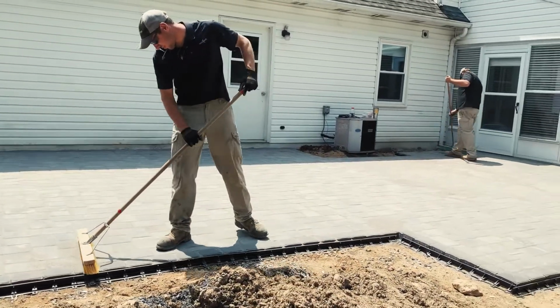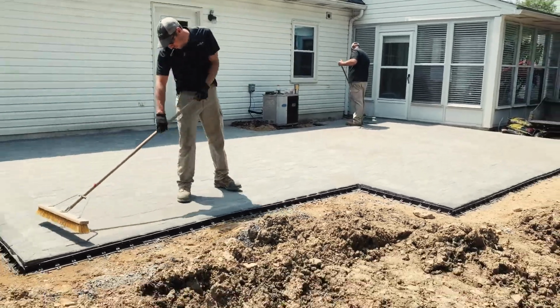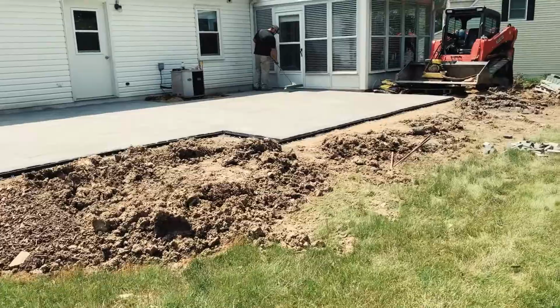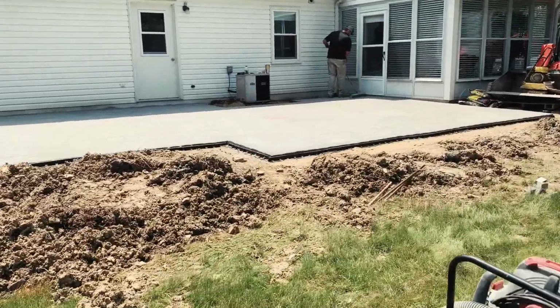Almost all methods of adding joint materials to pavers call for using compaction equipment to consolidate or pack the materials being added to the joints. Proper compaction is another step vital to achieving correct joint interlock. In this step of construction, you will ensure using either a vibratory roller compactor or a smaller plate-style tamper with a specialized pad added to the plate to keep from cracking your pavers.